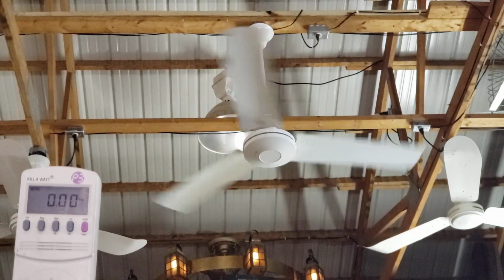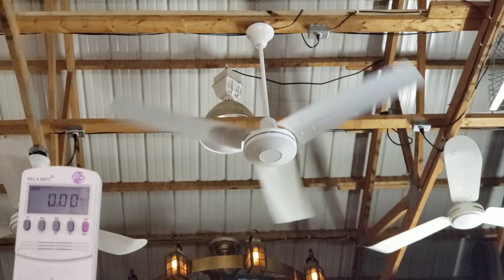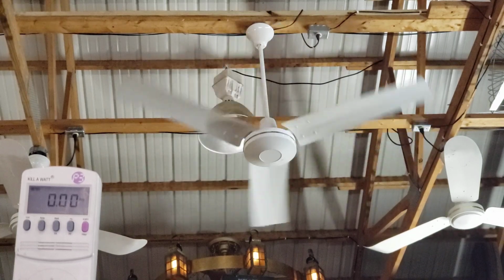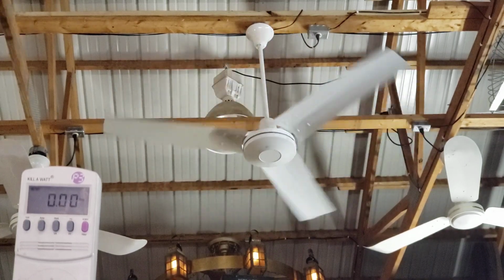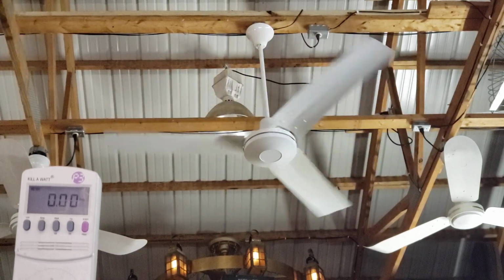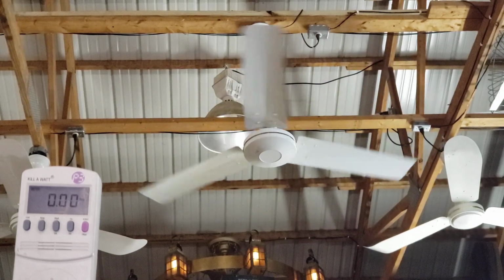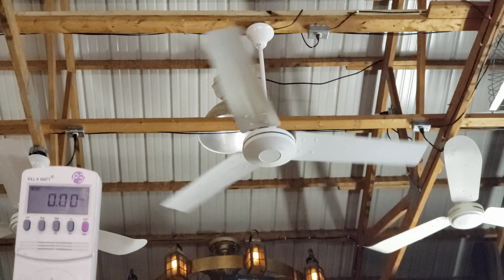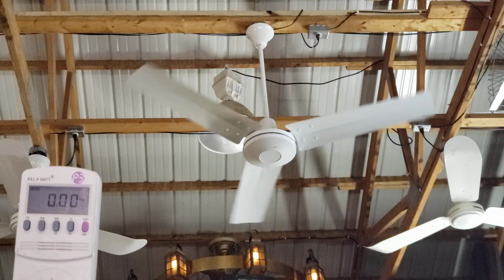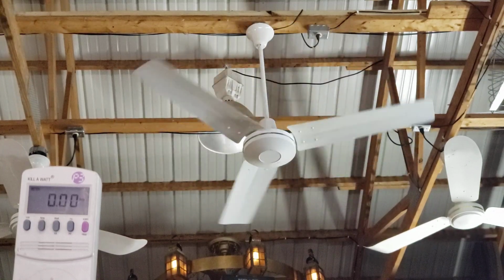Oh, it's true. I'll kill the enclosed gear. Yeah. Okay. It does make a difference on the line voltage. It probably wouldn't if the wire from the power company to this building was correct. It's a little bit undersized. Although I think it's the same size as we used to hook up the cheaper electric rate panel at Youth Center. But the difference is that was like a 3-foot run inside the meter base. And we're talking about an underground buried cable that goes like a block. I mean, who knows what that cable is like?